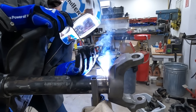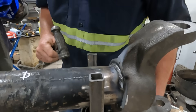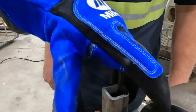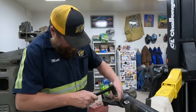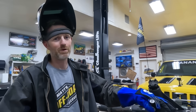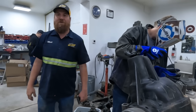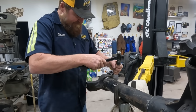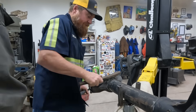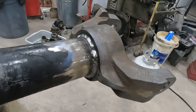If we can get this in that range that would be great, if not it will be a compromise. I really can't do anything meaningful here until this is welded and cooled, so let's light up the old torch. We're up to temperature — this thing's almost 300 degrees. We're going to start welding on it. We're going to do a little more welding with the nickel 55 rod and then move on to the MIG welder. First time ever hooking a ground up. Got it on the third try. No cracks — that is beautiful.